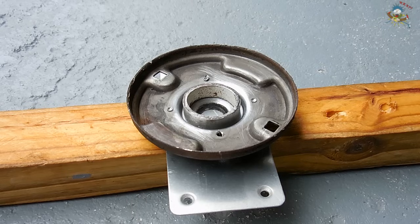For a piece this size, a regular propane torch will be just fine, but if you're working on a larger area or thicker metal, you're definitely going to want to use a MAP gas torch — otherwise the workpiece will not reach the right temperature to melt the brazing rod. The first thing I'm going to do is take the end of the brazing rod — the last inch and a half or two inches — heat it up, not to the point where it's going to melt but just make it hot, and then dip it into the Hotmax Brazing Flux.